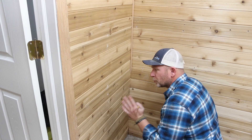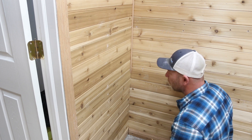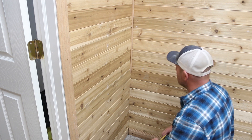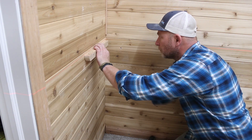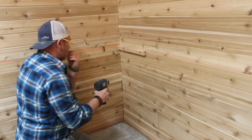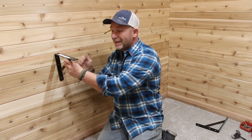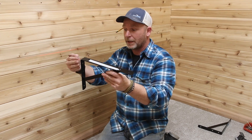A typical desk is about 29 to 30 inches, but I have a couple of holes in the wall at 32 inches that I really want to cover, so I might be a rebel on the height. On the edge I'm going to have a wood support going all the way through, and through the rest of the top I'm going to use steel angle brackets — 12 inches coming out and 8 inches going down — to support it really well so there's no sag.